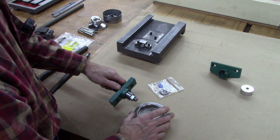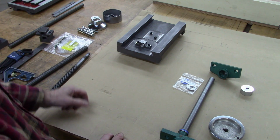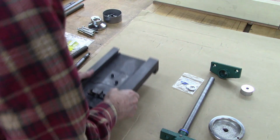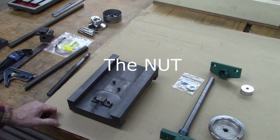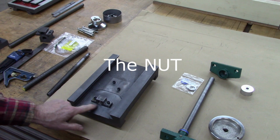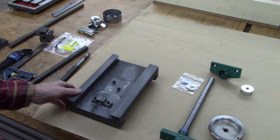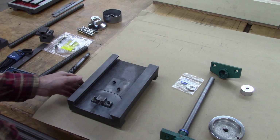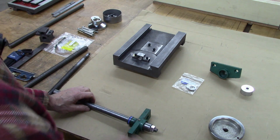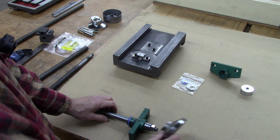I was trying to avoid any kind of mill work and make this doable with just a lathe, and I really believe you could do that. This right here, I used a mill to notch that out. I could have taken a bandsaw and cut that out, no problem. Machine the whole thing and then cut out those cutouts. Probably would have been a better idea than trying to hog all that off with a mill anyway. So the next step is to build the real lead screw with a longer thread here where I can put my handle on it.